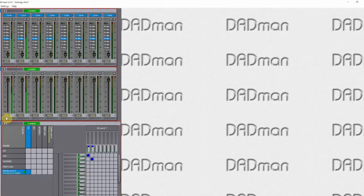Down here you'll notice it says 18.0. This means that if you apply a 0 dB full scale, i.e. the maximum digital signal that you can make, you will have 18 dBu output level on the analog side. So the maximum output level you can have with this configuration here is 18 dBu. So this is perfectly suitable for equipment that has a maximum input level of 18 dBu.